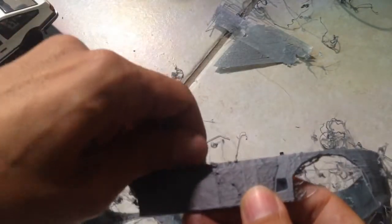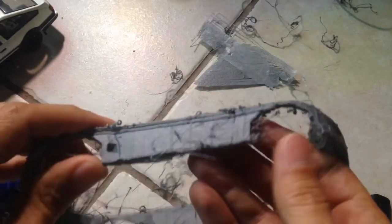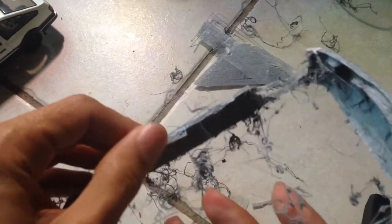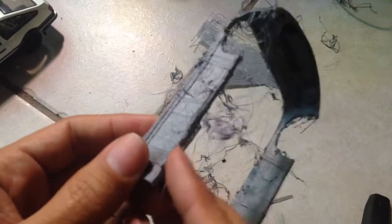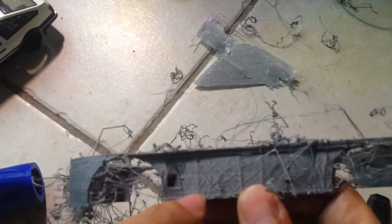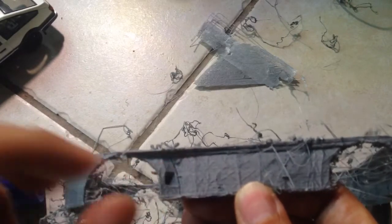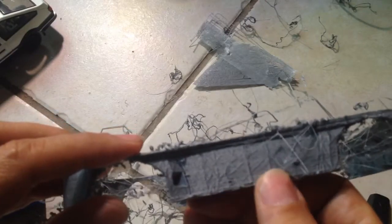If you look at this shell very carefully, on this side everything seems pretty smooth, but over here you can notice there's some layer shifting going on and a problem right there. What happened was it looks like when the first layer was put down this part lifted off. I tried to glue it back on but it still wasn't great, and it progressed fine until this point right here where you see this line — and then it probably came off the build plate again.